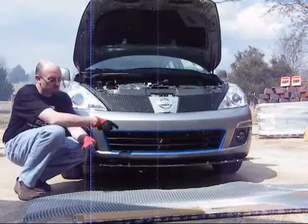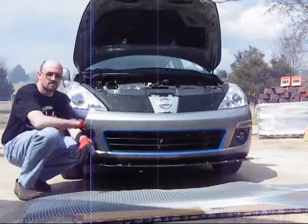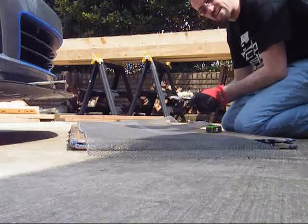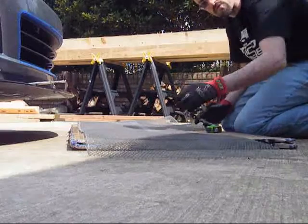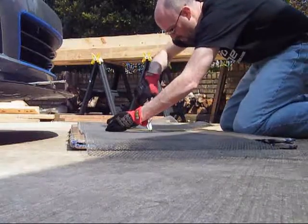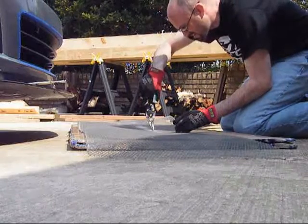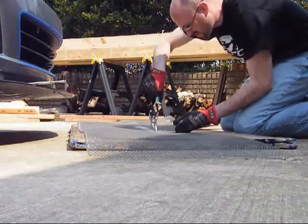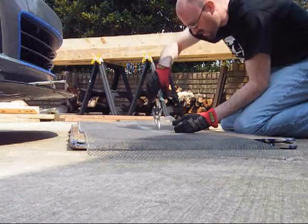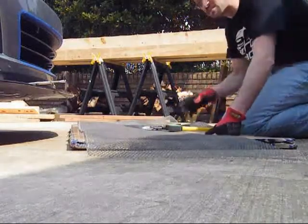To start with, I'm going to measure this width, which is going to be 39 inches, and I'm going to cut it to seven inches tall here, so I'll have a rectangular piece, and then I'm going to start fitting it to the grill. I'm going to use a set of tin snips — these are straight, versus a left or right hand cut. I'll cut up seven and over 39 using a tape measure. Remember, you want to stay oversized on all these cuts to start with. It's a lot easier to get smaller than it is to go larger, otherwise you'll need to start over.